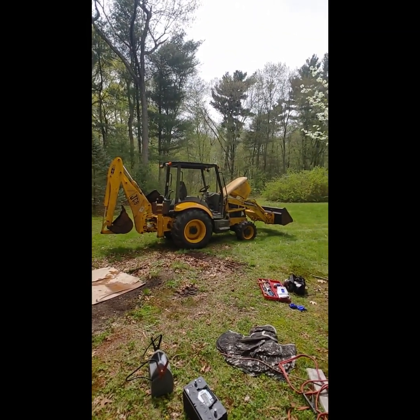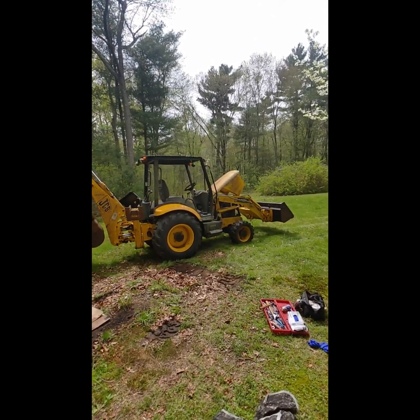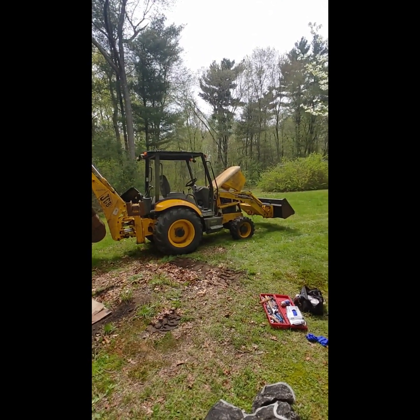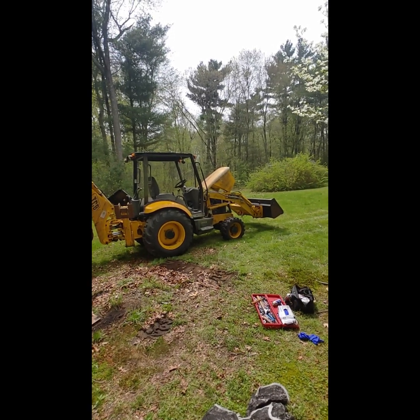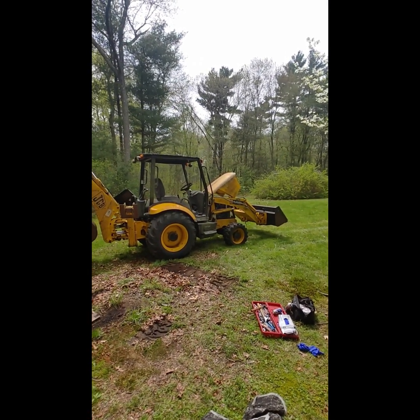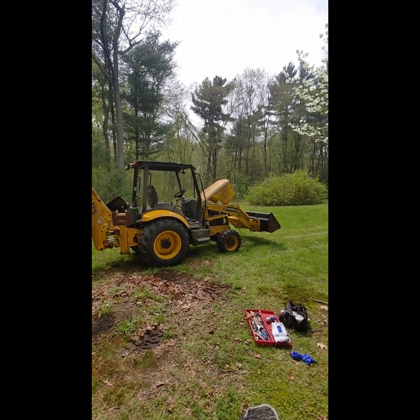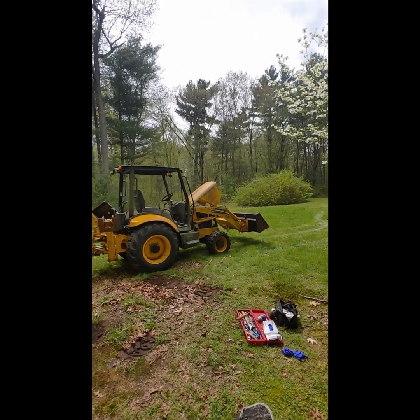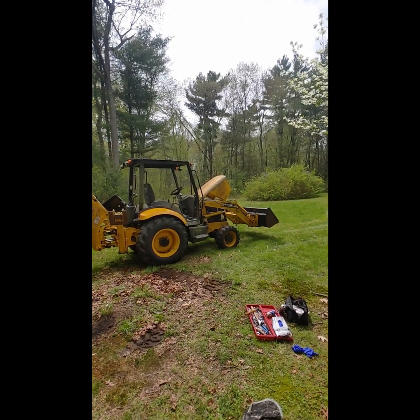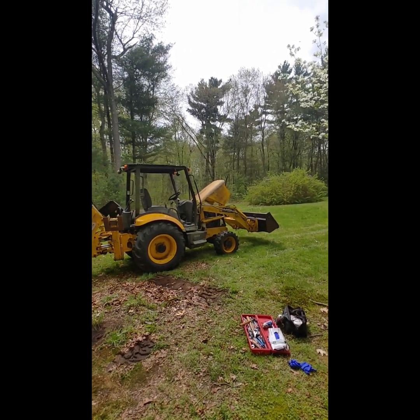I'm so thrilled. It's working. And it's staying running. There must have been some piece of gunk or debris stuck in that rack on that injector pump and causing all my problems. I love it. I think that's the longest it's run. So now, here's the true test. Let's shut it off and see if it restarts.